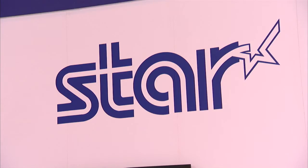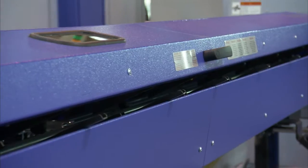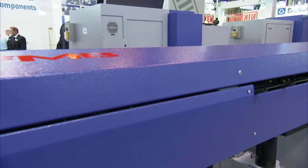So costs on material are reduced? So where would the remnant go, Alec? The bar feed pulls the remnant back through the guide bush and it's deposited in the remnant tray on the bar feed. And the size of the remnant? It's reduced from approximately 300mm down to about 80mm in most cases.